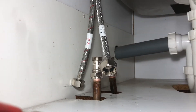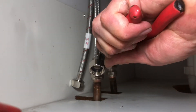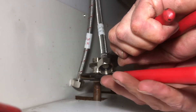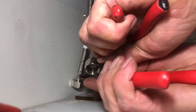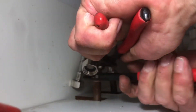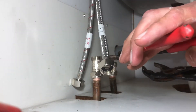Let's look at this one. I'm going to grab that with this here — notice I'm not grabbing the thread in the middle of the valve, and I'm not touching the bit you turn on and off with, because it's an isolating valve. It'll probably leak if you've got your grips around there.